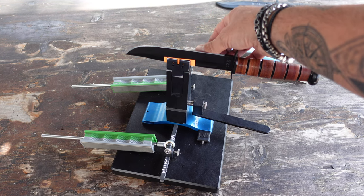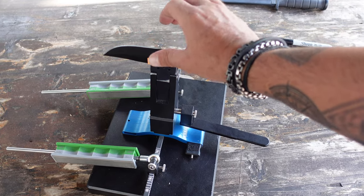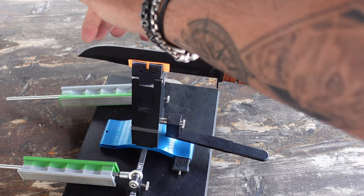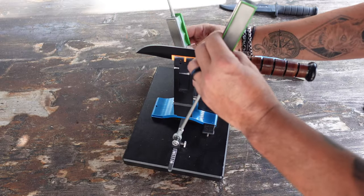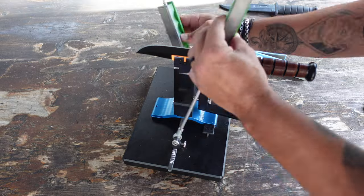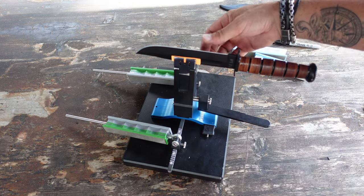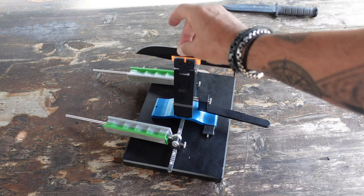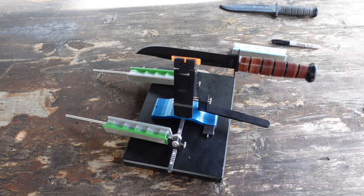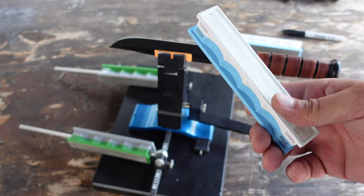Okay, that's feeling pretty smooth — I'm already getting that nice sharpness, just bringing this blade a little bit more back to life to its original condition. Now let's move on to the 2200 grit. I could already feel that razor edge and for most blades we'd be done right here, it's good to go. But since I have my 3000 grit, let's add a few passes with the 3000 grit just to give it that little bit extra that this Ka-Bar deserves.